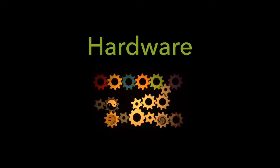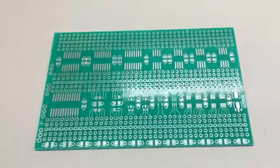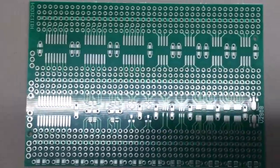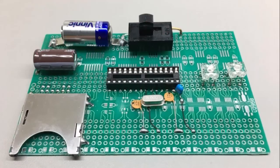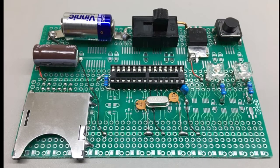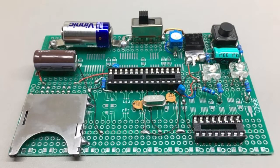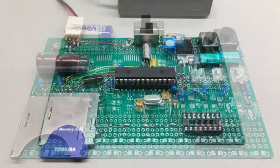So the twist that I planned to add to the unboxing video was to make a device that simulates GPS hardware. I've started with a DSPIC33FJ128GP802, connected to an SD card slot because I'm planning on implementing the Microchip Memory Disk Drive file system. MDDFS takes care of your SD cards, compact flash cards, and USB drives.